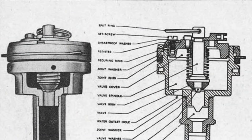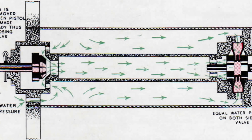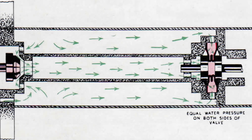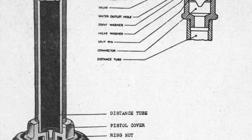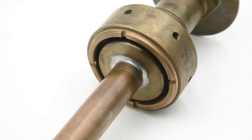These aircraft pistols also had a different type of safety mechanism known as back flooding. Rather than an adjustable orifice plate, the top of the pistol retained a spring-loaded plunger valve normally held in the retracted position by a removable safety pin. This would allow water to flow both into the primer tube around the pistol and also into the distance tube, meaning that if the depth charge was accidentally dropped overboard, water pressure on both sides of the diaphragm would be equalized and the pistol could not be cocked or fired. However, if the safety pin was removed, the valve would close, shutting off water access to the distance tube and allowing the pressure differential needed for the pistol to operate. The Mark 14 Star and Mark 16 Star pistols were designed for easier fitting to Mark 8 aerial depth charges, fitted with an inertial safety clip, and had their distance tube soldered on to prevent water leakage essential to the back flooding safety mechanism.